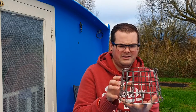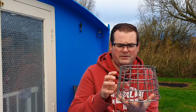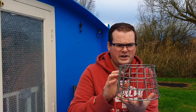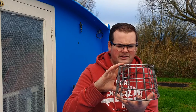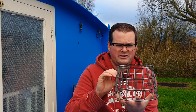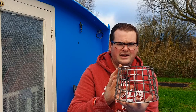Fortunately there is, so let me introduce you to the coal cage. This is a very simple design that allows you to do just that. Rather than having lumps of coal spread across the whole bed of the fire slowly burning, this allows you to create a big tower of coal right over the grate, maximizing airflow. It gives you such precision over the burn of that coal. Let's go inside and have a look at it in action.